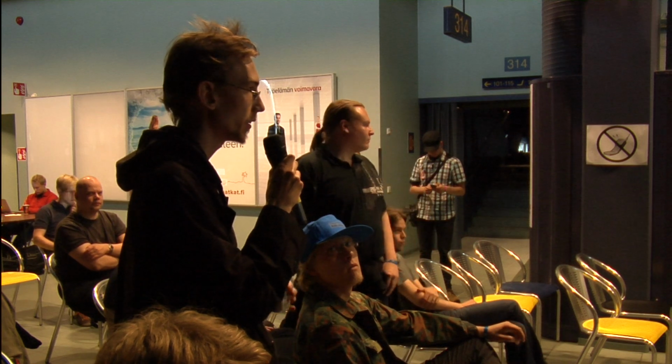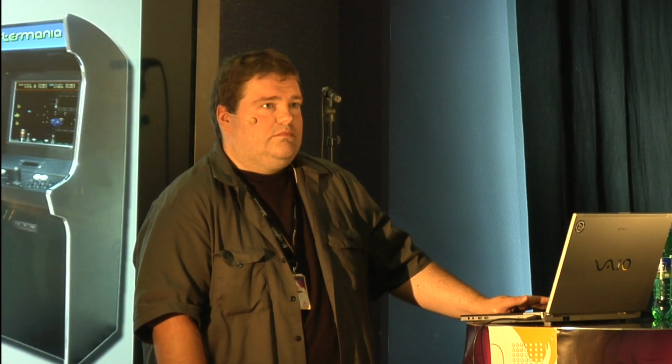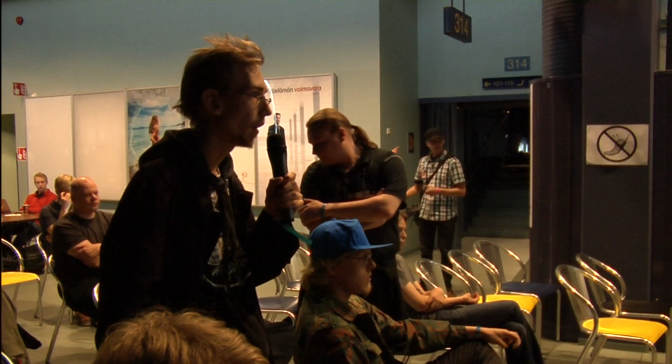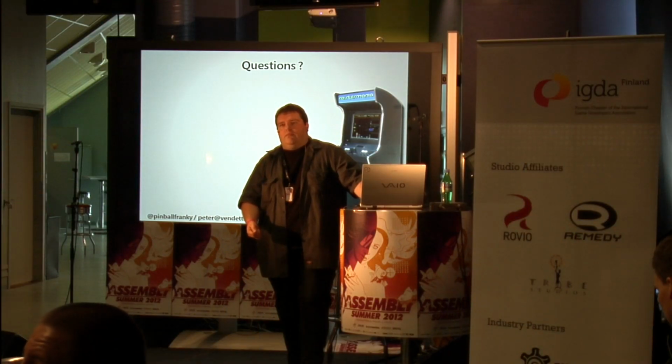At one point you were talking about this software which enables you to make the PC video card output a 15 kilohertz signal, Soft 15, right? Soft 15, yes. But can't you do it with a program called PowerStrip or similar, which can add new video mode options for Windows? Yes. What you are doing is adding video modes. You are adding registry values, which will allow your video card to enable these. You can do it with Regedit. If you know the keys, you can do it yourself. PowerStrip is also an option. I use Soft 15. I was just wondering if there are preset files for PowerStrip or similar software in the arcade enthusiast forums. Do you know anything about that? No, I don't. I don't really follow PowerStrip, sorry. Okay. Thanks, that was my question.